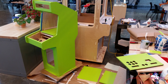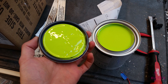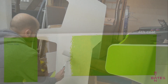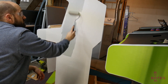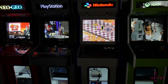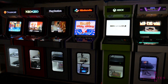I like to keep finishing and painting pretty simple. I recommend you wood putty and sand any imperfections on the body surface, then prep for paint. Both a quality primer and top coats are recommended. Follow your paint instructions and don't cheap out on the nap roller either — a roller will ensure a uniform surface texture as opposed to a brush. I prefer paint over a full vinyl graphic overlay as an aesthetic choice that leverages the marquee I'm planning for these cabinets. These are console-themed arcades, so the console logo and associated brand colors is the prominent thematic point.